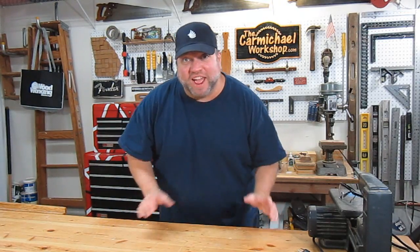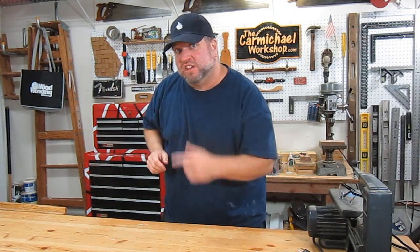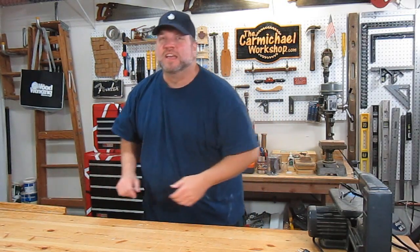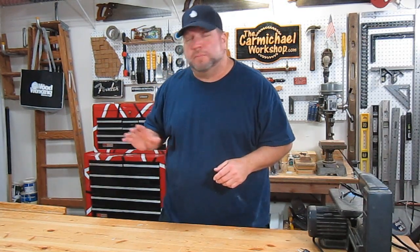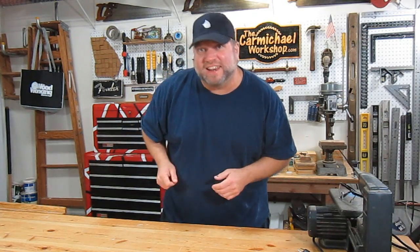Alright guys, I've got the round tabletop here and it's ready to go. And I've got this giant spindle column that I turned over on the lathe and it looks great. And I had just enough scrap to make these three pretty table legs. So now that I've got everything cut out and sanded with 220 grit, it's time to do some assembly. I'm just going to assemble it with some glue and a few brad nails.